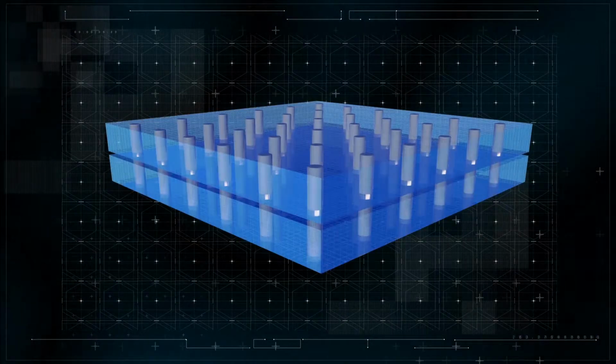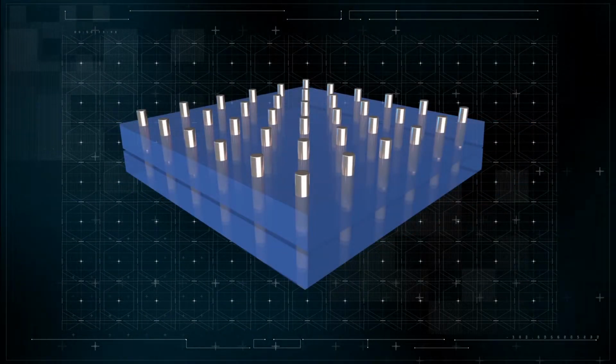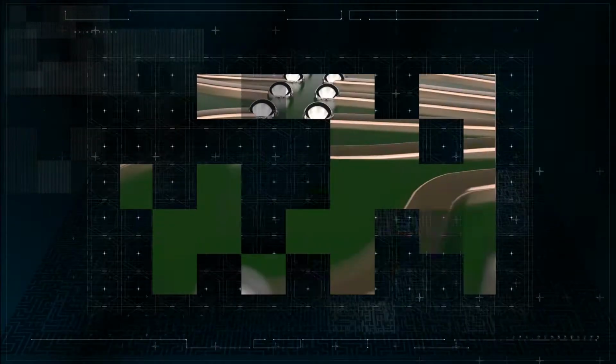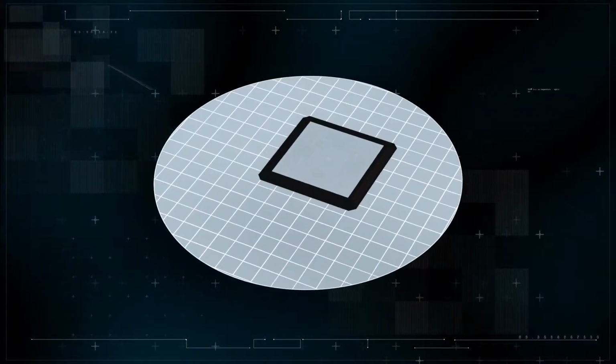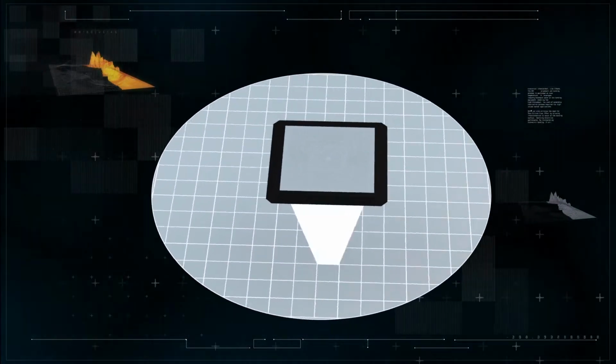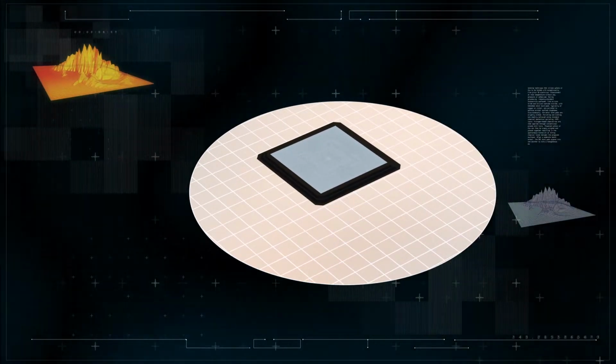Through silicon vias, fabricated in the backside of the analog wafer, must be revealed by a thinning process. The bonded pair is now ready for photolithography and etching to pattern the openings and prepare bond pads for wire bonding or bumping done in later packaging operations.